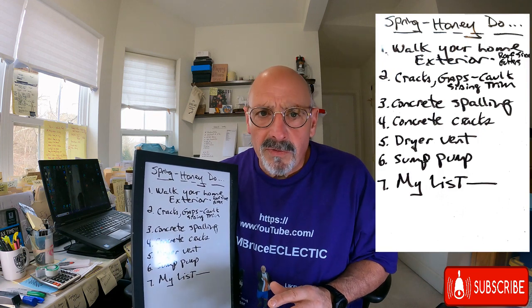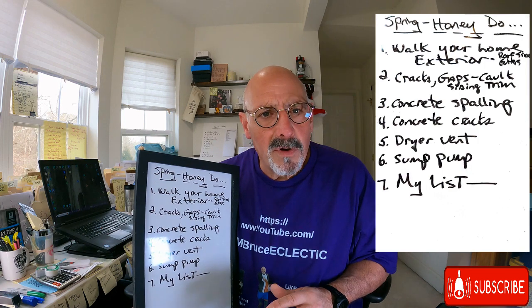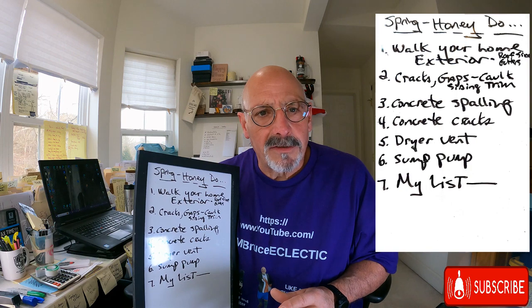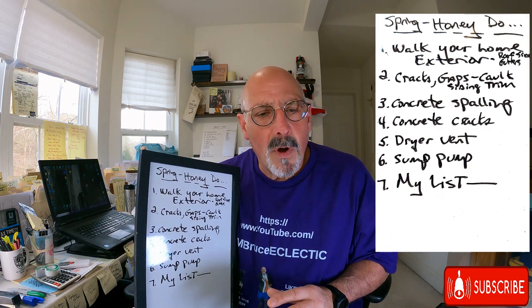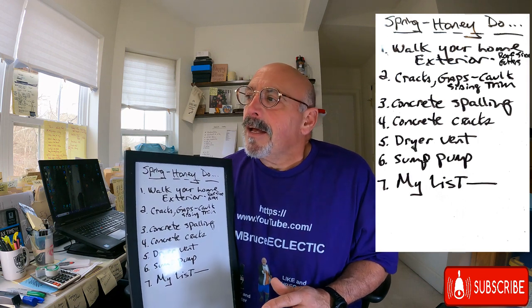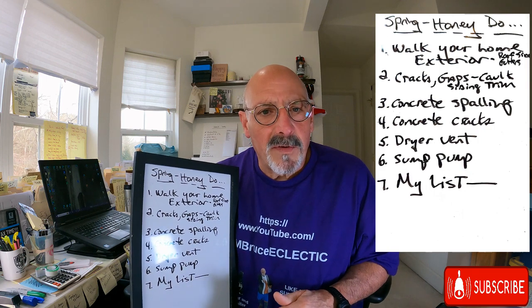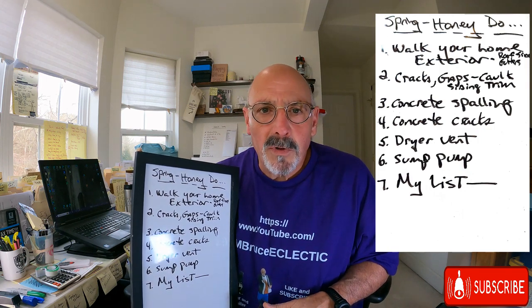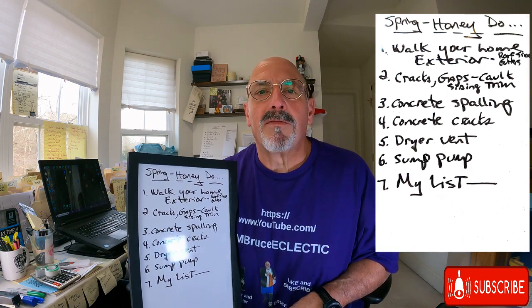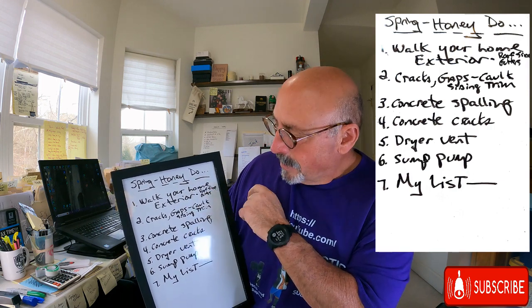When you caulk, if you need to caulk, use the best caulk that you can afford. I always tell people to use, depending on what it is, you might want to use a clear silicone, but typically a paintable caulk, and use the best that there is, because typically that'll last for several years. So even though you want to walk around spring and fall to make sure everything's good, the odds are if you use a super good caulk and you apply it properly, you won't need to do it spring and fall. So walk around the exterior and see if something needs attention.